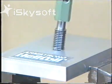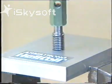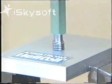It is preferable to gauge the tapped hole, as opposed to the finished assembled hole. If the tapping is incorrect, then corrective action can be taken. If the finished hole gauges incorrectly, the helicoil must be removed and replaced.